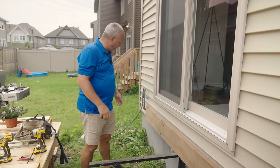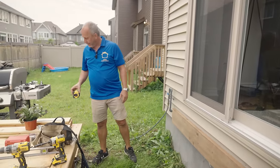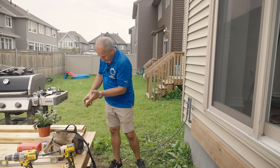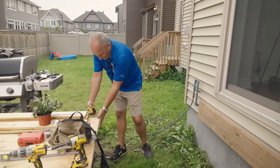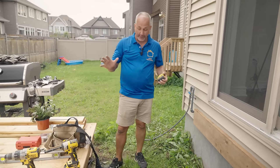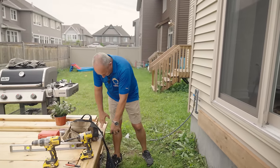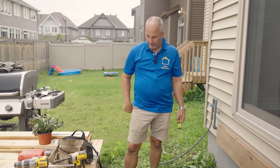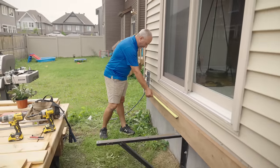But what we're gonna do is just work out our plan here a little bit. I'm gonna have a privacy screen coming right across surface deck, 6.5 feet tall. And I'm gonna build this platform out to meet the deck, but just shy. So it acts like a step, but this will float independently of this. Okay, so this is attached to the house, and this isn't. Four season weather, we can heave in the frost a bit if it needs to be, it won't be a problem. We'll leave like maybe 1/2 inch of a gap just for everybody can be comfortable.